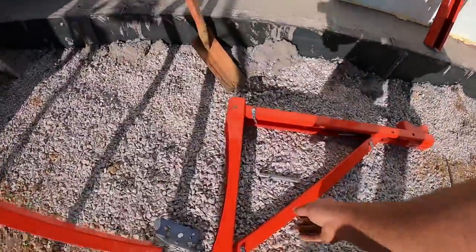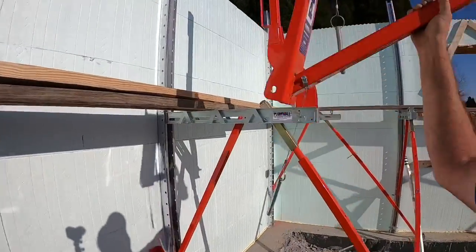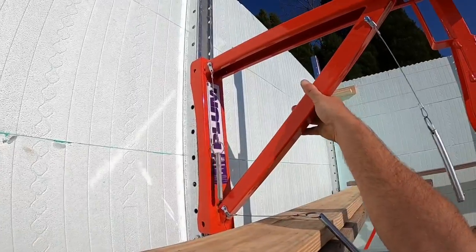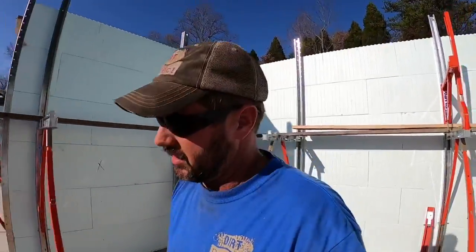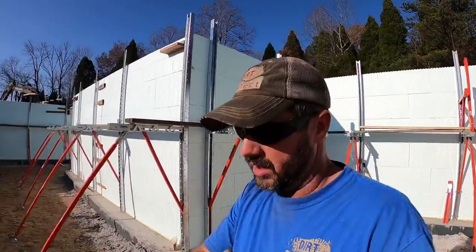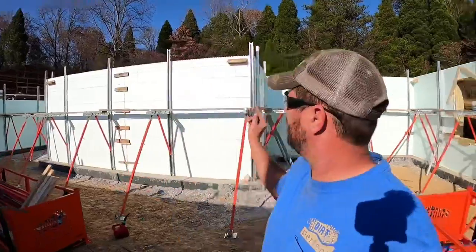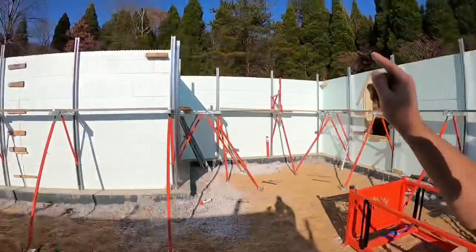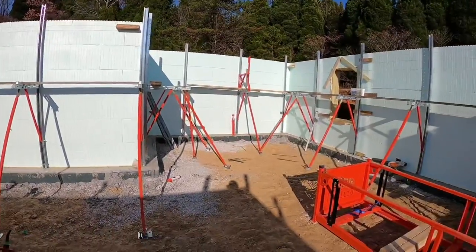The other thing is they got these brackets, and I don't know how many times over the years I wish I would have had these brackets. That bracket will basically clip onto that rail, just like that. And you're like, well, why would I ever use that thing? Two scenarios come to my head right off the bat. One is pouring gables. We used to pour houses, we'd pour a gable, so you'd have a wall going up and coming back down. Well, with those brackets, you could step your walk board up safely.